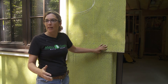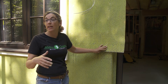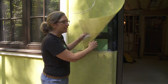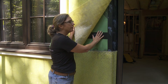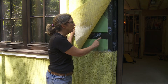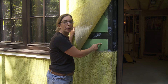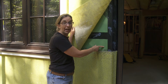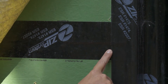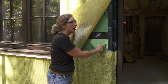In earlier discussions, we talked about how the building is constructed and the importance of air sealing and sealing your house against the weather. Going from the inside to the out — this house is constructed using a sheathing called ZipWall, which we've talked about before. This is a breathable membrane: it doesn't let air in, it serves as an air barrier, but it will let moisture vapor out of the house. The house is then taped with the zip tape, so all of the seams of the ZipWall are taped, which provides an air seal for the entire home.